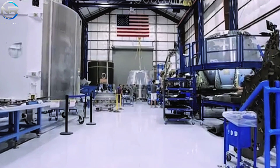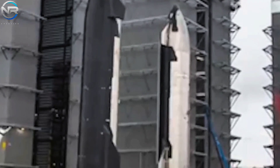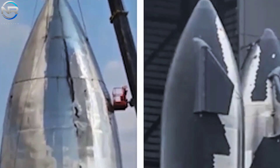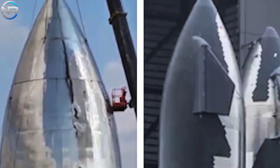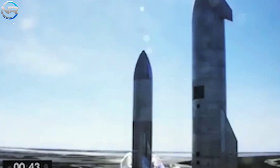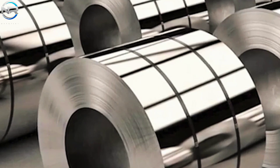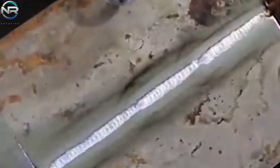A pivotal advancement in the evolution of Starship was the shift from 301 stainless steel to 304L stainless steel. This advanced alloy provides enhanced corrosion resistance, a vital consideration for both manufacturing processes and functionality in the extreme conditions of space. The improved formulation of 304L has resulted in welds that exhibit up to four-fold greater strength compared to previous iterations, while simultaneously enhancing the material's ductility by 25% under extreme temperature conditions. Moreover, its minimal carbon composition contributed to the mitigation of cracking, thereby bolstering the rocket's overall reliability.